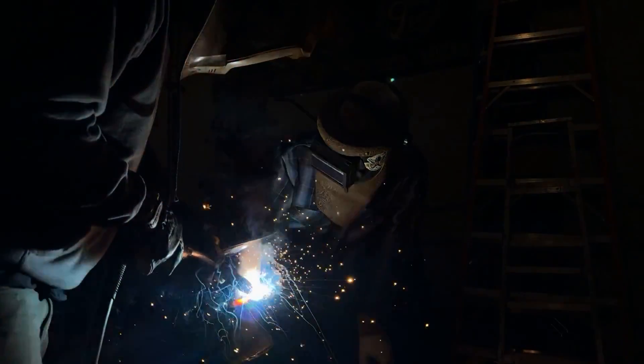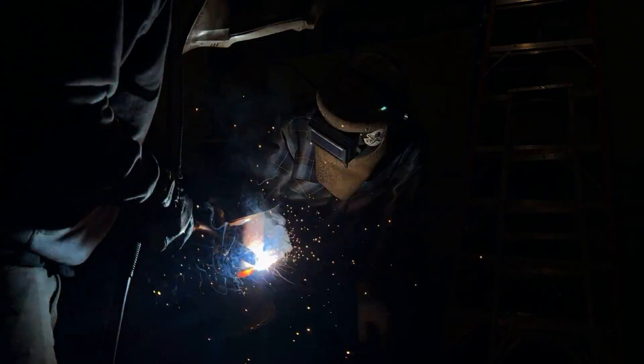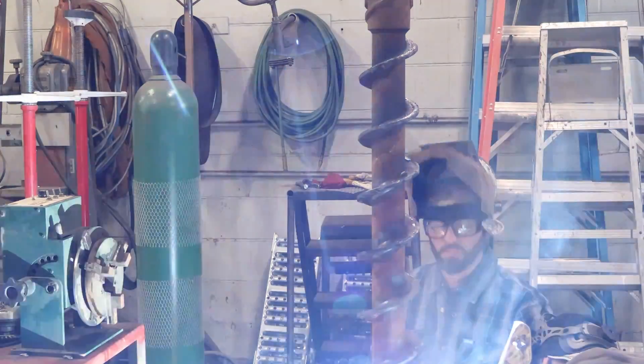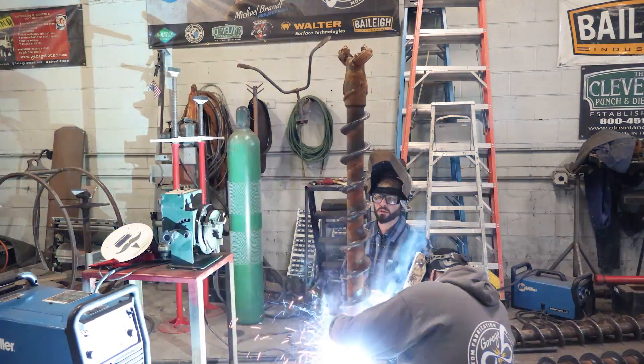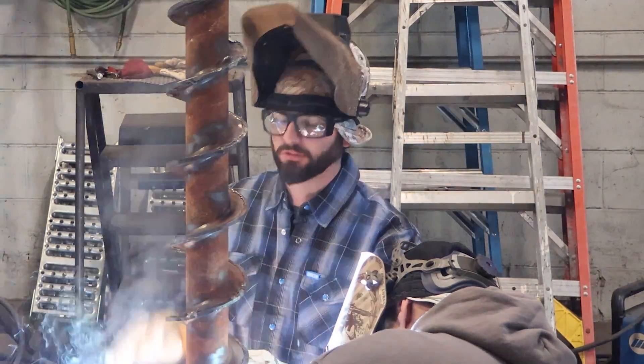As we troubleshoot this metal core wire, we don't really know what the base material is other than the square stock we're using. We are getting some pinholes here and there, but this thing is going to get worn down again and again in the field, so a little bit of a pinhole here and there is going to be kind of okay for what we're doing.